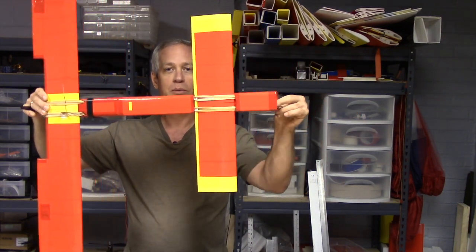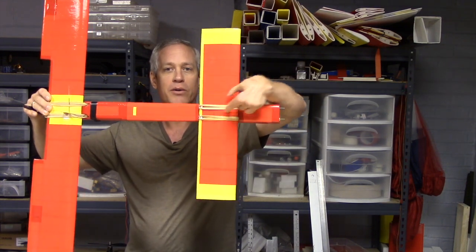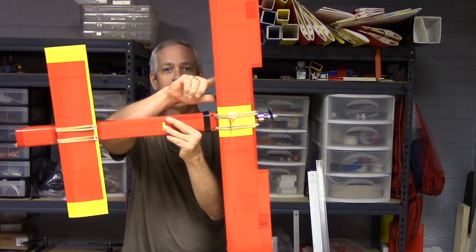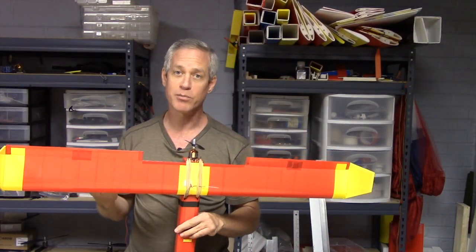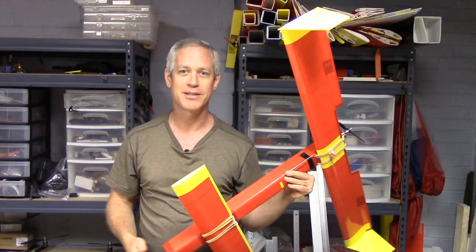The extension is partly to place additional weight up front, and also because the hatch is located under the canard. I intend to switch this around so that we have a tractor — mounting the main wing back and the canard wing up by the propeller — just to experiment with this design using a tractor motor instead of the usual pusher, just for fun.